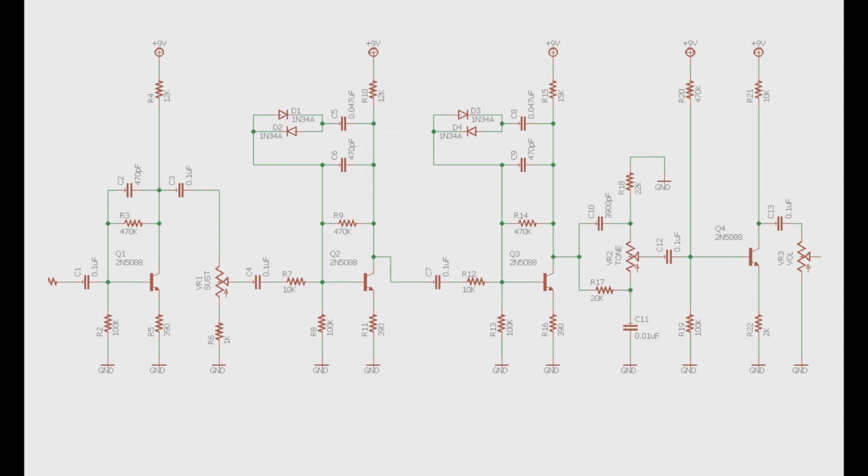For smaller valued capacitors, like anything under 1 nanofarad, the signal may be too small to hear, but ceramic capacitors larger than this may be a problem. You can test to see if this is an issue by tapping a plastic pen or any other solid non-conductive item on parts of the PCB while engaged and hear if it makes any noise.